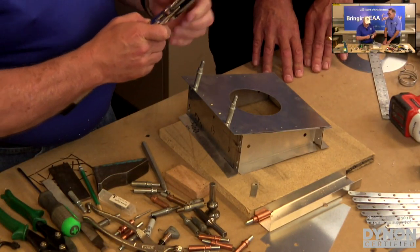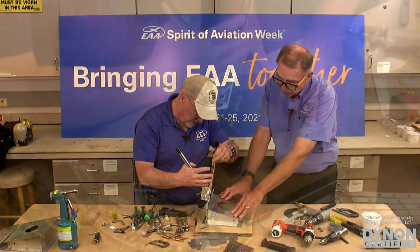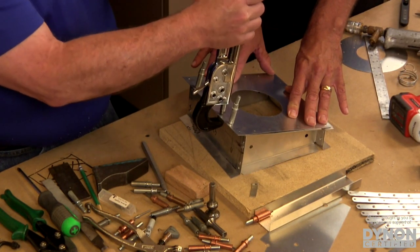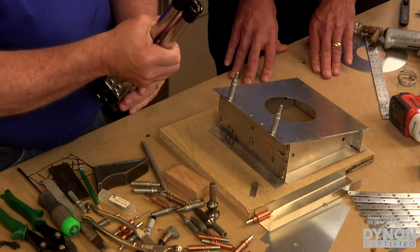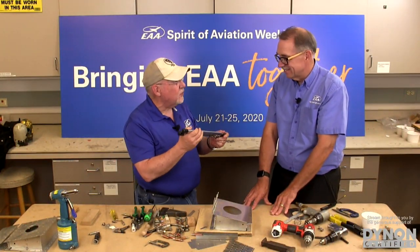With the squeezer I found sometimes that little anvil, because of the amount of force, actually flexes a little bit. And you can go back and do it again a couple of times. Every time you do it, the rivet gets a little bit harder, so ultimately you won't be able to squeeze it anymore because it'll harden itself. But that's the other way to do it. And this is, again, very quiet, very easy. And if it's accessible like that, this becomes a one-man job with the squeezer.